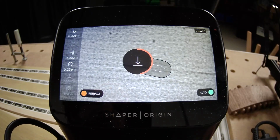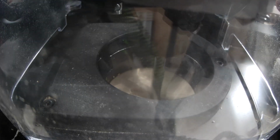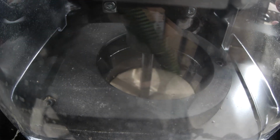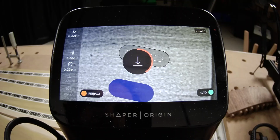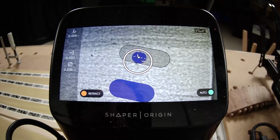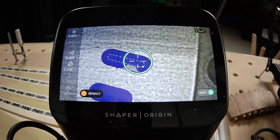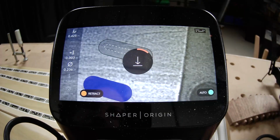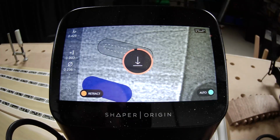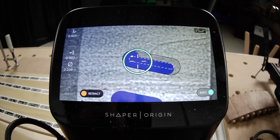I like that bit, Cam. Nice. Super easy to cut through. When in doubt, always ease into a new material or a new type of hardwood. You don't know how it's going to react to that bit or just being cut, whether it be long grain or end grain. Work up to the confidence to go to full depth on certain things.